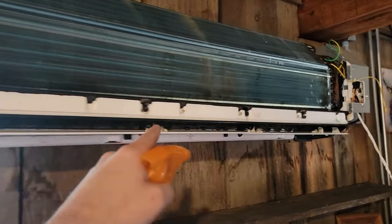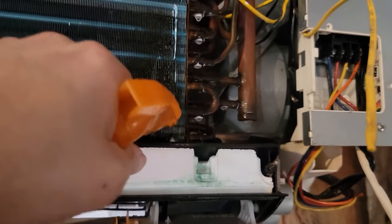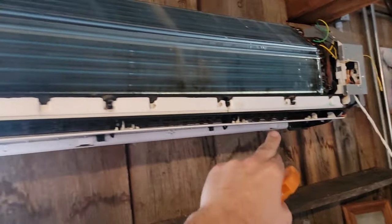You turn it on heating and you've got 200 PSIG — you feel this vapor port and this vapor line — you're probably not going to have any warm or hot line. I've seen this temperature get upwards of 150 to 180 degrees — it gets so hot you can't touch it. If you don't have those type of pressures, you could have a low refrigerant issue. I've got this unit running in heating with my gauge hooked up — this should be upwards of 300 but it's only 200. I go inside and we've got a leak right here on the indoor coil. I'll order the indoor coil — should be under warranty.